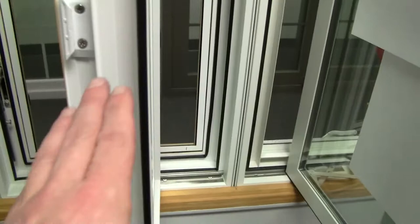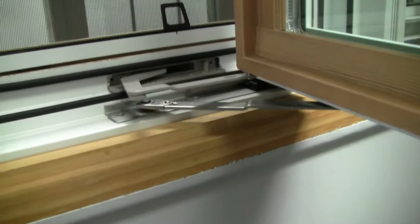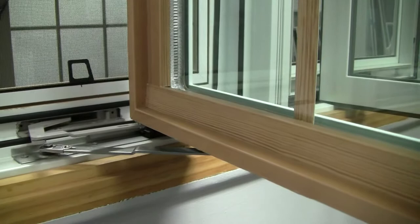This company here — same height window — has two locks and a two-and-a-half-inch sash. It is triple weather stripped. The hardware is addressed by going in from underneath, which is more structurally supportive and a lot more aesthetically beautiful from the inside.